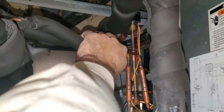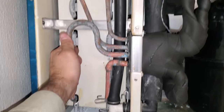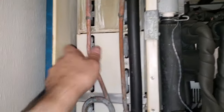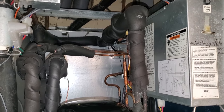We're going to start this guy up, make sure it works, and then we'll disassemble it and clean it. The machine has started up. This valve right here is feeding hot gas into both of these lines — they're both really hot. I've got to insulate that a little bit better. We're going to start it again because that was a really short harvest cycle, but the machine is really warm so that might be why.